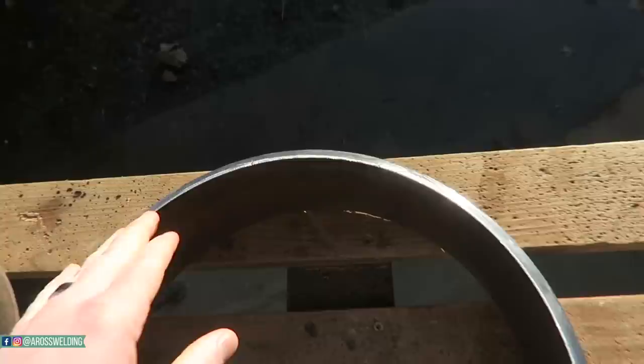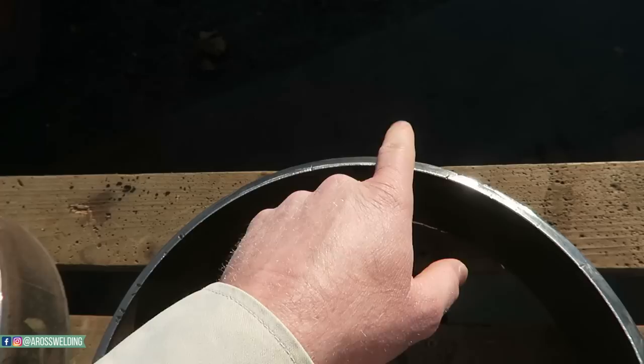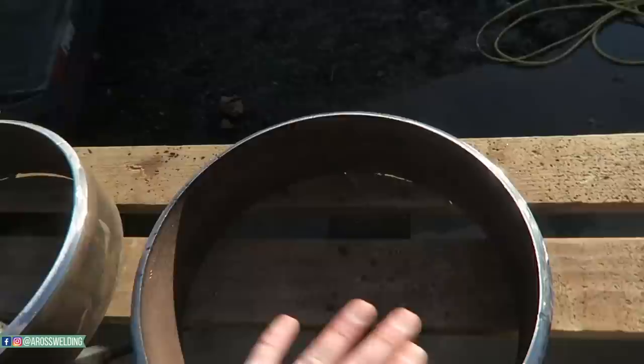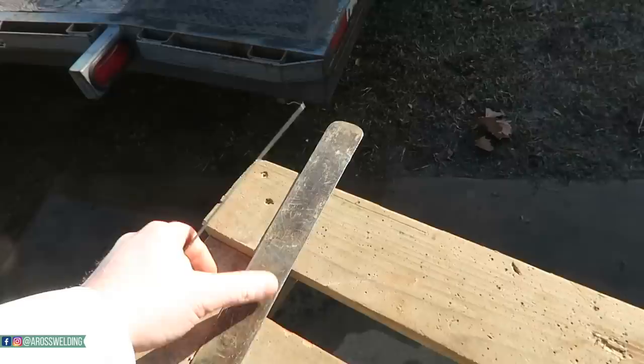So now remember, whenever you pull it off and sand it, I marked it from here to here, and I'm just gonna sand it. That's gonna make my landing. Right now I got about a 16th. Sanding it will make it a little bit heavier, so you'll want to lay your bevel back just a touch to thin that landing back down and make it all perfect. So once you have it perfect, for the sake of this video, I'm going to go ahead and go to the next step, which is putting my spacing bands in.